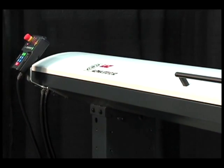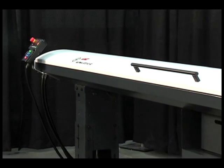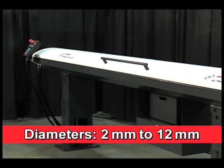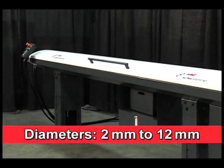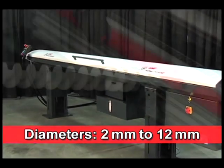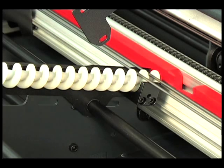This 3S system is standard on another Alpha model, the ST212S2, designed to accommodate bar diameters from 2mm to 12mm, and which shares many of the features of the ST320S2. The Alpha ST212S2 also has a unique screw mechanism that advances by one pitch each time it automatically loads a new bar.